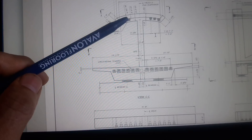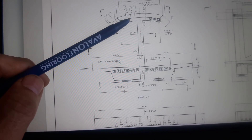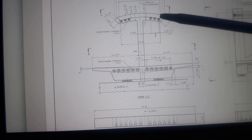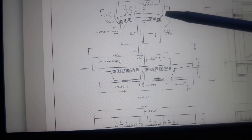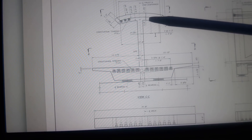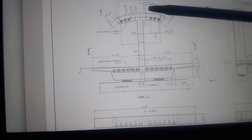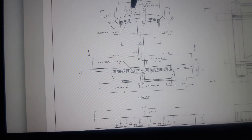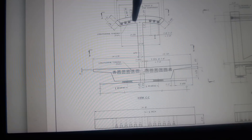It all comes down to the plate — if the plate fails, you get failure of the cable or the stay. Looking at all the images online, none of these plates failed except this one. In one image it looks like here and here might be missing. With that said, the blister is in here, and when they're pulling down on it, it's trying to straighten out this arch.